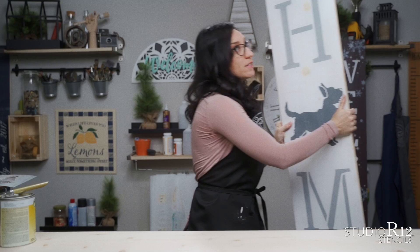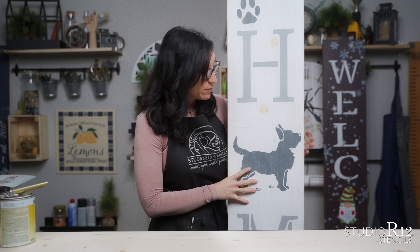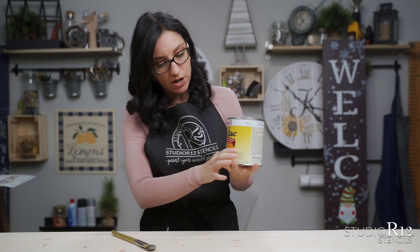The first thing we're doing with this board is showing you how to treat the knots, and let me show you why. This is one that we did quite a while ago — it's been here for a few years. It was one of our first porch signs that we painted, but look at all the knots and how they have bled through the paint. Thankfully we now have a trick so that won't happen to you. We treat the knots with a product called Bullseye shellac — we just paint the shellac right over top of those knots and it will treat them so they won't bleed through your paint.